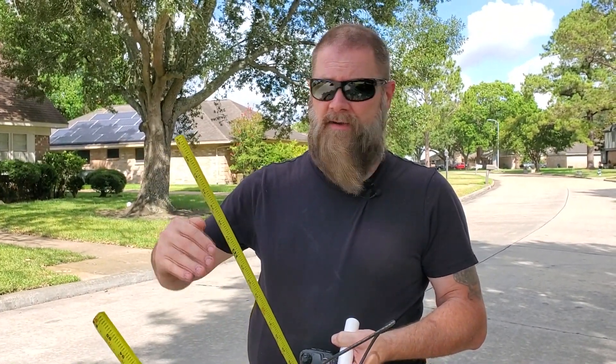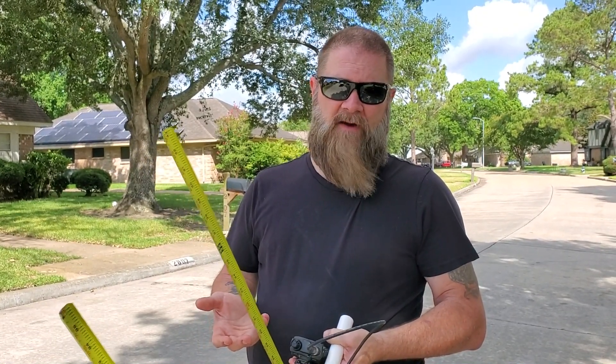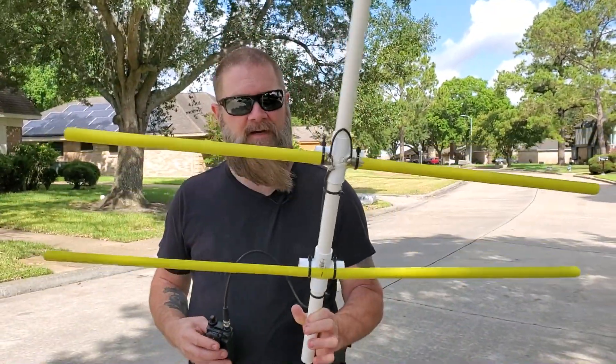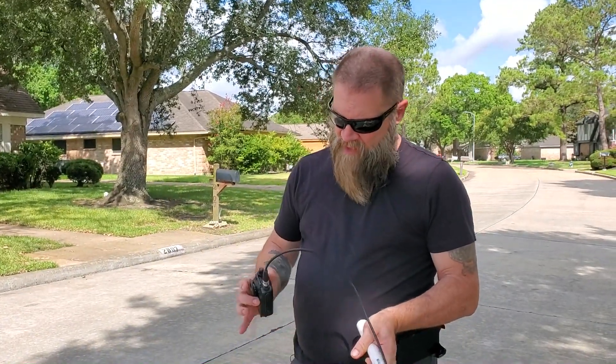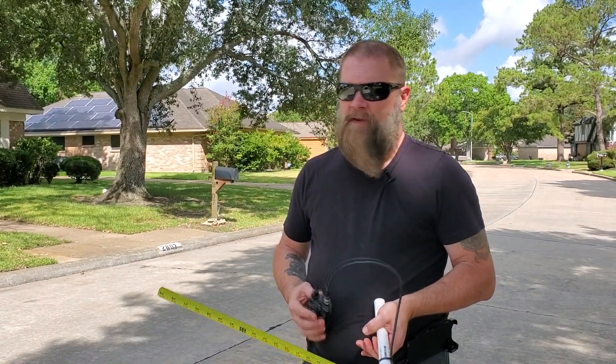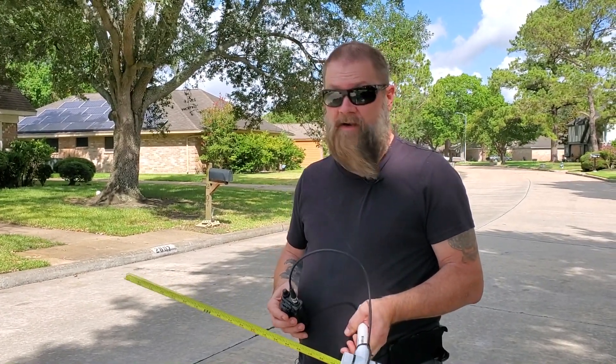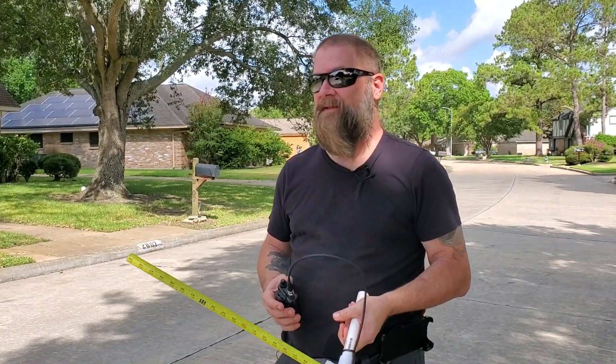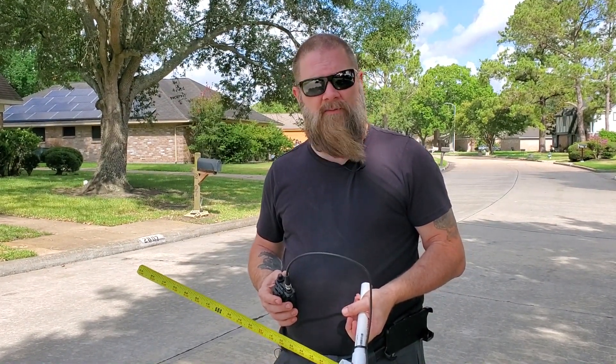This antenna paired with the HT on AM — 40 meters was the band that was really the worst on my radio — really helped me hunt down where the RFI was coming from. As you saw in my previous video, I've actually talked to the homeowners and they're going to work on getting that resolved. If you have an RFI issue in your neighborhood, you can build this antenna for about 15 bucks and an hour of your time. It also works as a two-meter Yagi for fox hunting.